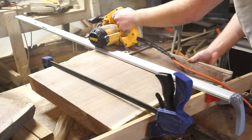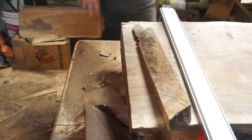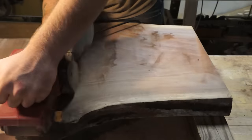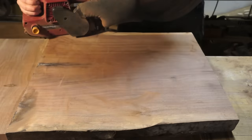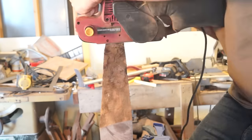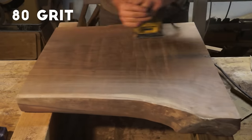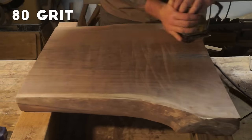If you're going to be doing this with a circular saw, I cannot recommend a straight edge more — I would almost say it is 100% necessary. Because I already had most of the slab flattened when it was in one big piece, most of what I'm doing here is sanding for aesthetics as well as sanding down epoxy. I was surprised to find that the belt sander actually works great on the edges of the slabs because of the radius it has — it gets into all of the nooks and crannies. I decided to do all of the sanding on the legs before attaching them to the tabletop.